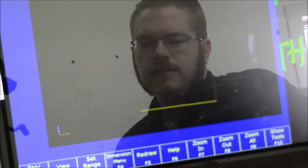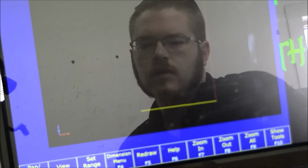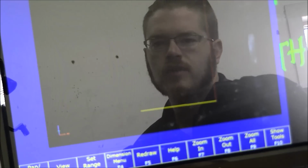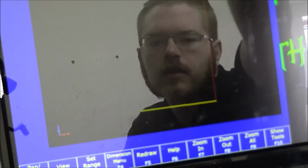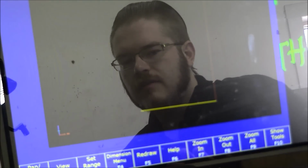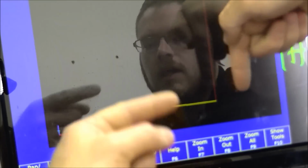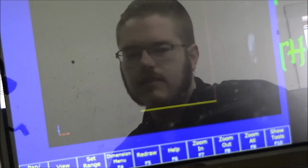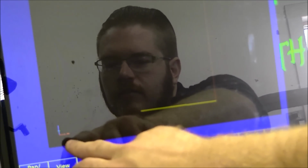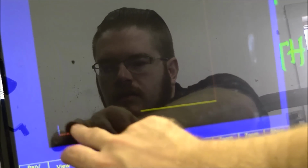So now we are looking at the cutoff tool's tool path. Now, one thing that you may not notice, which is incorrect about this tool path, is the movement of the part. So the part comes down from here through the rapid, and that's where things go wrong: the part is coming down and then moving to the left towards the tool. And that is the opposite of how we have it set up in the vise. And to make sure you're oriented right, I have my X positive is right, as you can see on my little compass there.